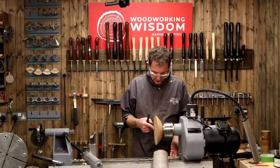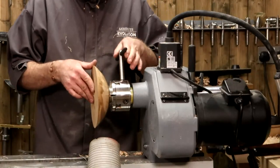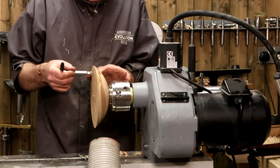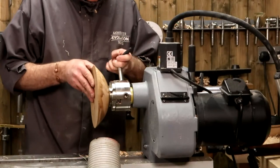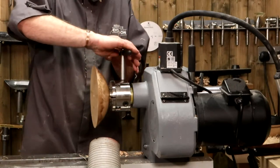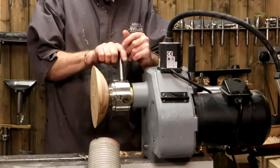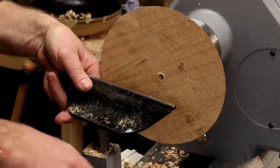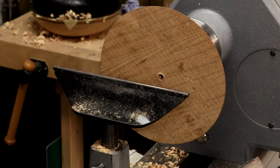Got a little bit of wobble on there. So let's have a look and see why. So take it back out, move it around just a touch. Pretty sure we squared that up. Might get a bit more. Don't go this time, we'll go with what we get. Play around. It's better. Tighten. Now I know this is going to dig in a bit. Pinched. Tool rest back in. Let the tail stock down so I've got a bit of room.